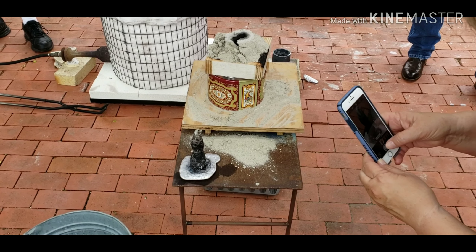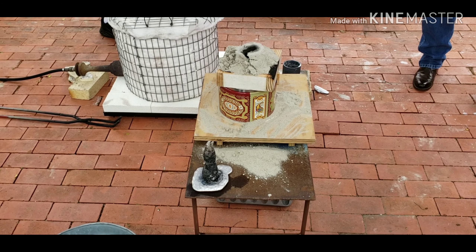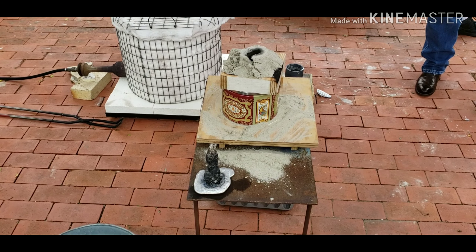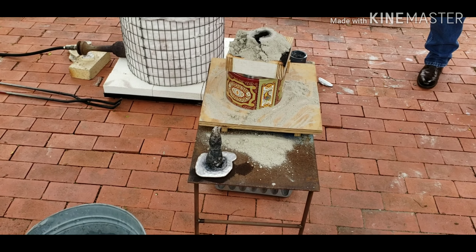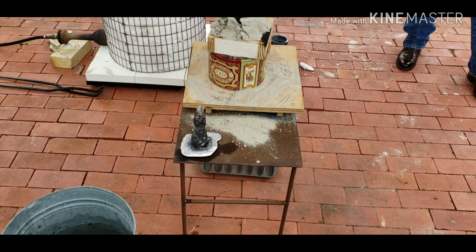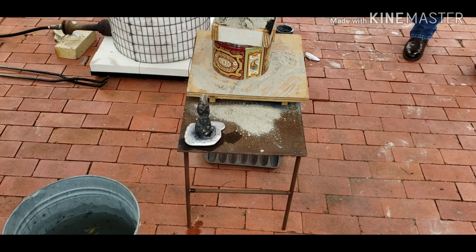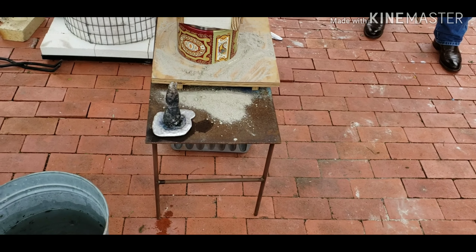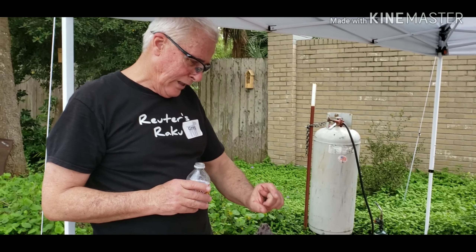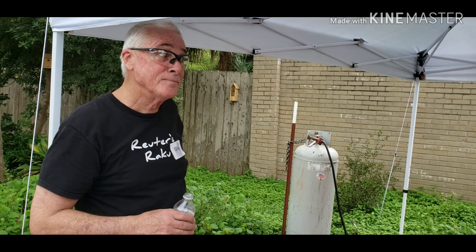I'm not going to do the finishing today, but I would start with a wire brush on a drill, then I would file and sand it, and then I would polish it on a buffing wheel. All of the stuff — it's all out of school. But I have a grinder that I think I can put a buffing wheel on. What you really need is a bench grinder with a buffing pad on it. I'll have one. I can see elements of wood and aluminum together, stacked — we're going to have to work on that. Some collaboration.